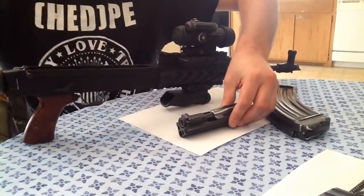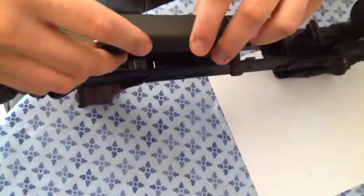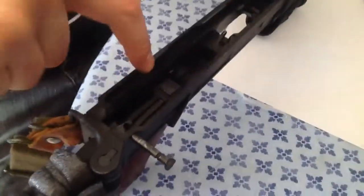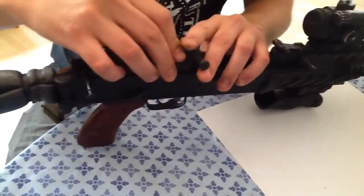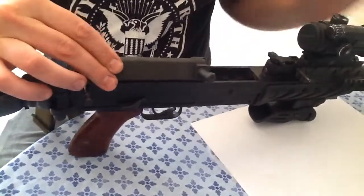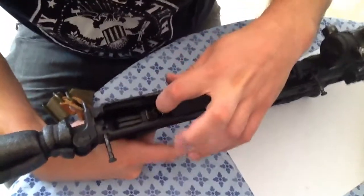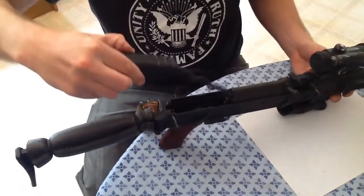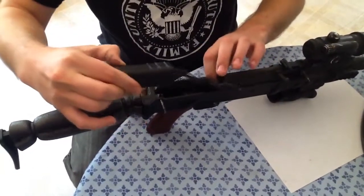I put all this back together. Putting it back together can be a little tricky because all this stuff could fall out if you allow it to. You'll see there are notches cut out here for the rails for the bolt carrier assembly to fit back into the receiver. I have to move the bolt forward just slightly to get it past a little bump in there. The striker is catching on the trigger, so when I pull the trigger the striker comes forward and I can bring the entire bolt forward. I just make sure the top spring is in the top hole and the striker spring is in the bottom hole in the striker without accidentally pulling it out — you have to get the longer spring in first.